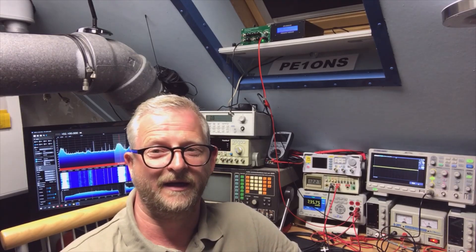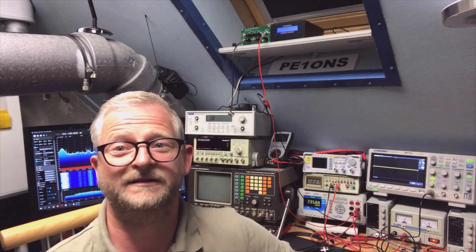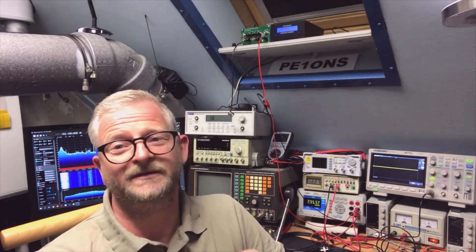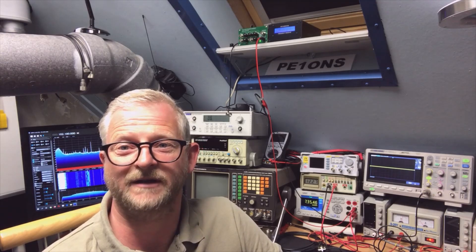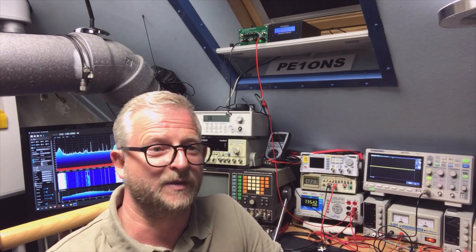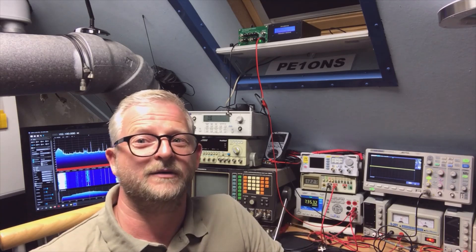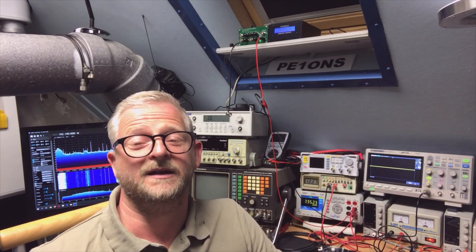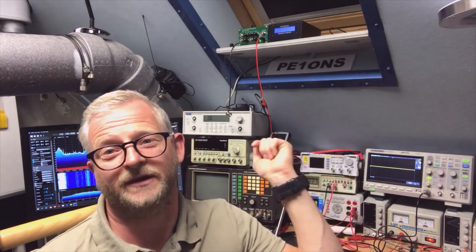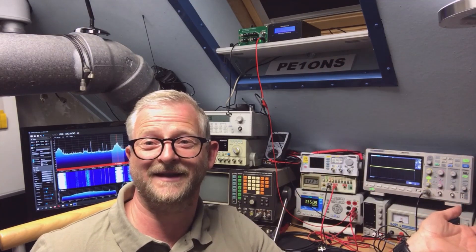So that's it — a very fast review of the GPSDO. What I've seen is it would make me very happy. First of all I can calibrate all my other devices that do not have an external reference input, or if they run on 10 megahertz maybe I can create one myself in the device, or just calibrate them. I can connect it to my Marconi and to my TTI. Then I always know that the frequency on the display is really what it is, and I don't need to worry about the aging of the oscillator because it will be corrected by my GPSDO. Thank you for watching — I hope to see you next time.